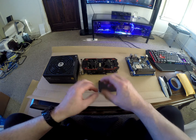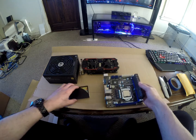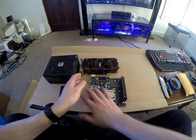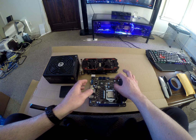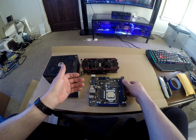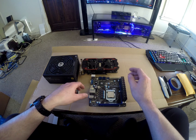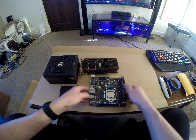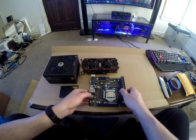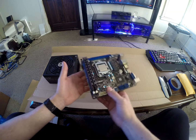All the cables are going to be black, the inside is going to be black. I'm going to be vacuum forming this motherboard so there will be a cover over the entire motherboard, with a small fan underneath for cooling - similar to the ASUS armor covers on their motherboards, but slightly different. The chipset heatsink has been removed because I'm also working on sand-casting a custom mono block, as covered in another video.